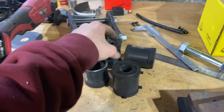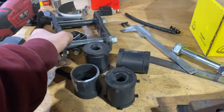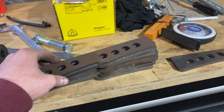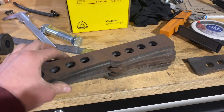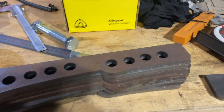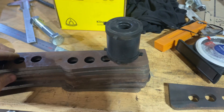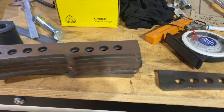Just made up these little tubes here — these will be our bottom A-arm mounts and they're off just a shackle bush. I got given a heap of these plates when I bought that lathe a while back and I've had no real use for them. So I'll cut straight off there and use them as tabs — that'll save me having to drill a heap of holes, make up a heap of tabs, and sand them all down. That'll make good use of those.